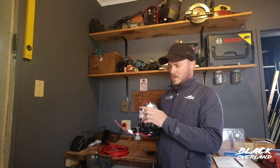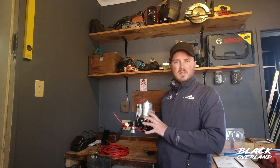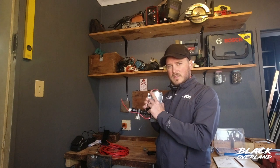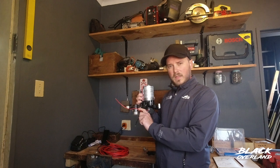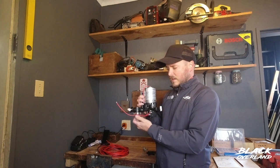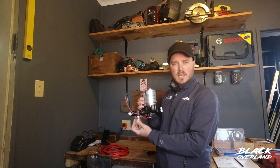There are more powerful pumps around, but because the length of plumbing in the trailer is not really particularly long I don't want something that's too powerful because it might blow the pipes. What's nice about this pump is that it comes with a filter and the connection fittings too. The filter is great so that you can clear any sediment that may have settled in the bottom of your water tank.